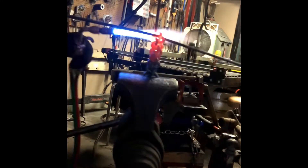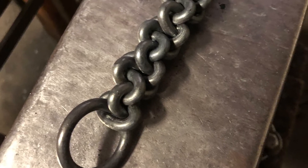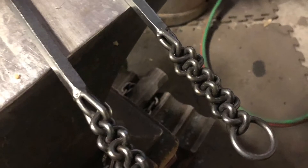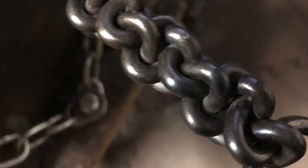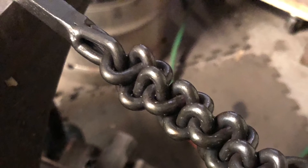When I get to the end, two of the bars are going to be difficult to bend up straight — they'll want to come unfolded from the stack. So I use the end of a chisel to hold them in place and press them out, then straighten all four out away from the handle. You'll see the handle shortly with the little forearms coming out of the top. I didn't bother showing the electric welding or the blending because that's pretty straightforward, but those are the finished pokers. Here are some zooms on the braided handles — you can see the areas where the weld is blended in, and I think it disappears nicely.